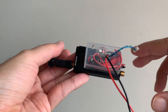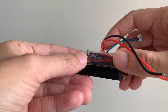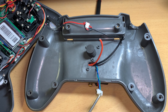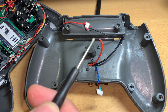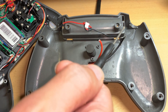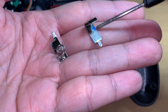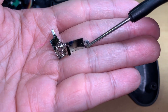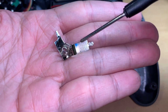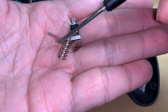The module is done and this is how it looks: the wires are all tucked in neatly. The relay and the step-up regulator are covered in heat shrink to prevent any short circuit due to the metal screws. The micro-Molex connector of our DIY module bay has to be connected to the port on the radio, and the red and black wires will be soldered to the terminals of the battery. I also took the opportunity to upgrade the ground tap — the original one can be bent upward, but over time it compresses and the battery comes loose. We're replacing it with a spring-loaded metal tap to give the tension needed to secure the battery and prevent any loose contact problems.